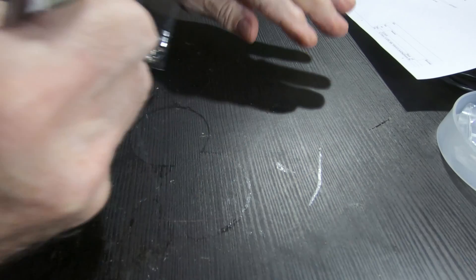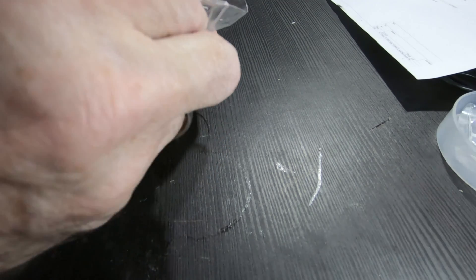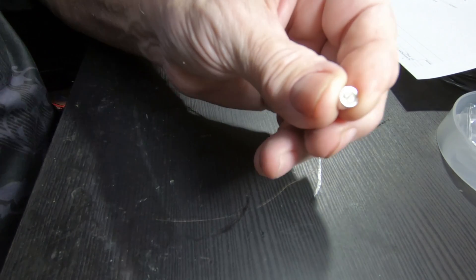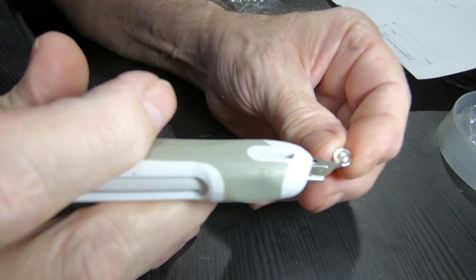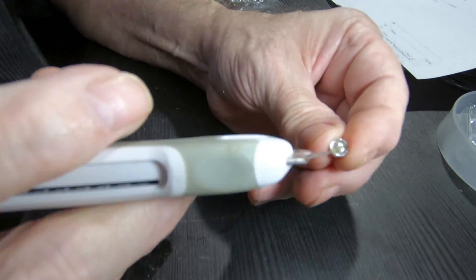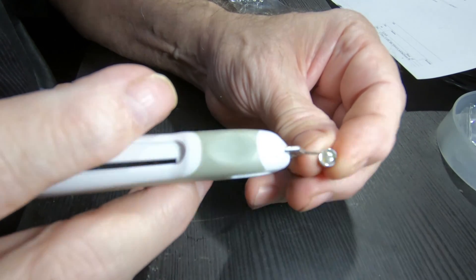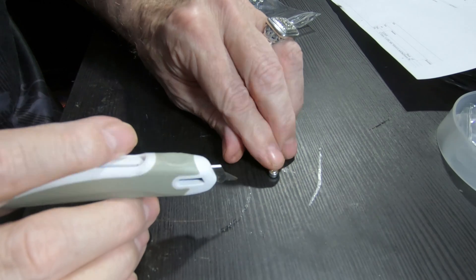Okay, first thing you do — get out a capsule very carefully. Make sure your table is very clean. What we're going to do is we're going to cut the trace that goes to the case. I don't know if you can see very well here, let me move a light over. This is the output pin here and this is the ground pin. Basically there are two pins and then there's the shield. If you can see, there's a little tiny trace right there connecting this number two to the case. I'm going to cut that trace very carefully using a very sharp X-Acto knife.